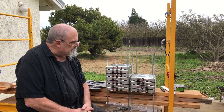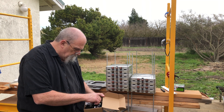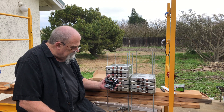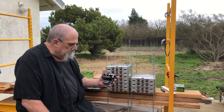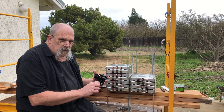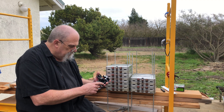I set up a charger that I picked up — it's just a little dinky thing, but it does quite well. This one is a boost and the other one's a buck, but they're from the same company. It'll take a low voltage and kick it into a high voltage, and you can charge up to 12 amps. It does constant current, constant voltage. We should have a diode on the output because when you shut it off it tries to feed back into the device, which I found out this morning, so we need to stop that from happening from the batteries.